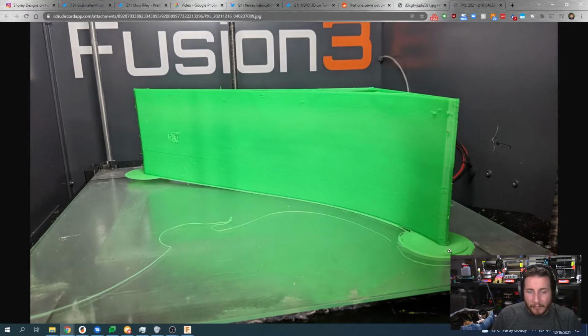Thankfully, this is ABS, so there is an easy way to recycle all of it. But we were just messing around to see if we could get ABS to print big parts without warping, and no, we couldn't. Even with some really big 0.4 millimeter thick ears on the 3 corners that exist on this part. So, hey, you live and you learn.